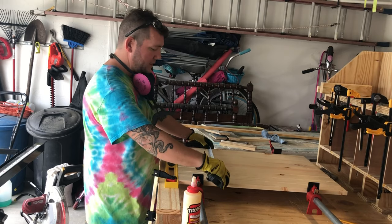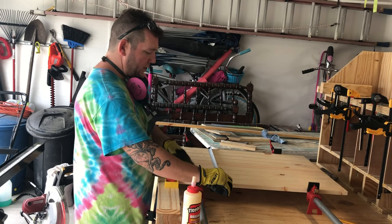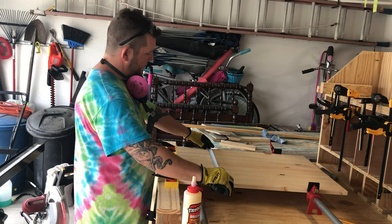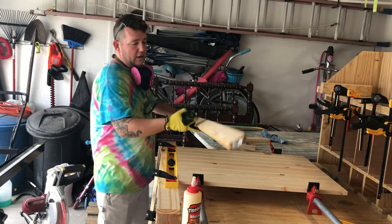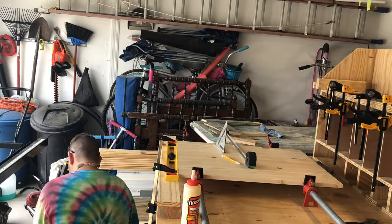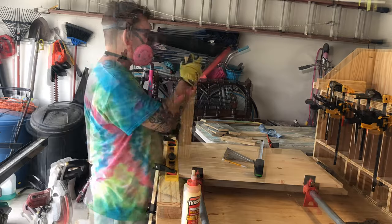Glue it and get your measurements. This is 22 and almost a half inches. I'm going to knock this runner — it's going to hold your handle — at 20 inches, that way you give yourself a little room. Just cut it out of your one-by-three, real quick and simple. Right here we're just cross-cutting the one-by-threes at 20. You can play around with the length and width — use a one-by-four or one-by-six, mess around with how it looks and your design.